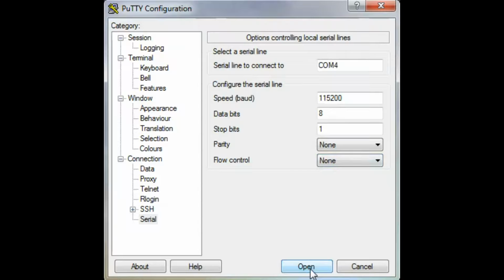This is important when first setting up the unit because the text-based menu allows you to determine the IP address of the unit that was established via DHCP. It also provides access to things like the cable card decryption page, so one can begin provisioning the cable cards before the web GUI is even accessible.